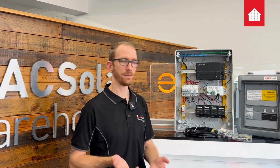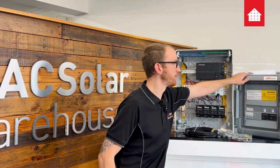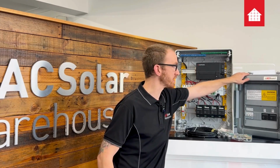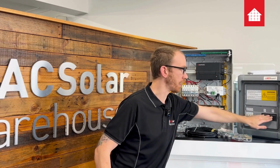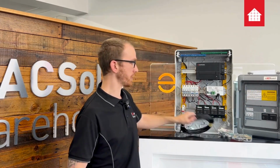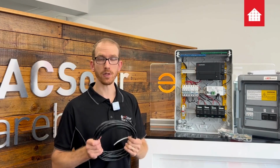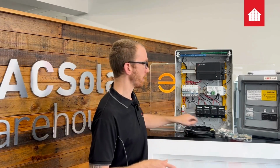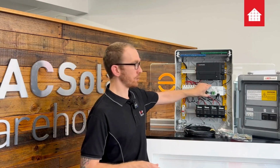You also have the option for a retrofit application for an existing site where you can put this subboard on the bottom of an existing board using these joiner kits, and here you have your breakers and your IQ relays along with the CK2 behind there as well. It also comes with communication cable for it to go from the CK2 to the batteries, and also the corresponding IQ battery label kits. You can also buy the unit on its own.